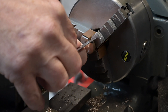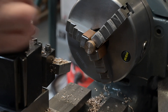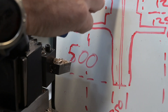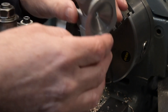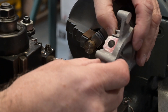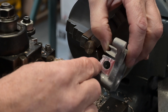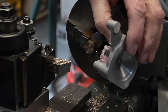Quarter - looks about right. So I need to reduce that dimension. Here's where we're going - we're going for 380 across there. The reason it's 380 is because I made a bit of a cock-up of these holes. I can't remember what I did wrong but I did, and this hole is 375, so I'm going to bring it down to 380, try it, and then hopefully get it to fit where it should go.